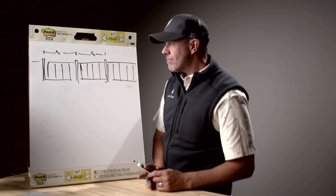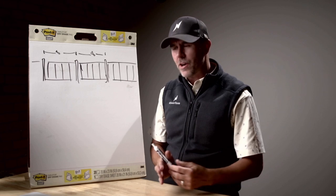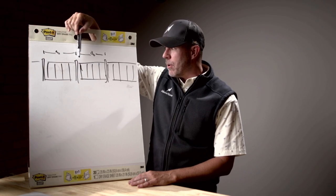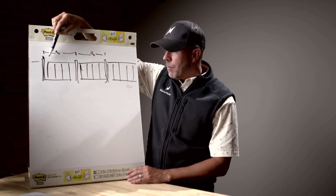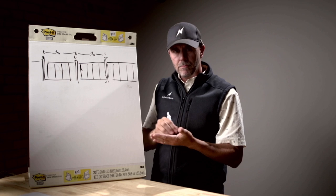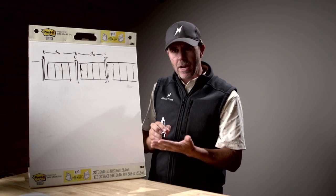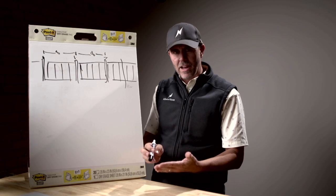The fastest way to measure fence: if you can tell the fence posts are all varying distances, this probably won't work well. But if it's a well-installed fence with uniform distances, I'm going to count posts — basically count eight-foot panels by the posts. I'll look down the line and count: one, two, three, four, five, six, seven, eight. On my scope sheet, I'll write PNT FEN — an Xactimate code — and it's a six-foot-high fence, times eight, noting which side it's on.